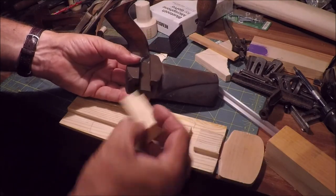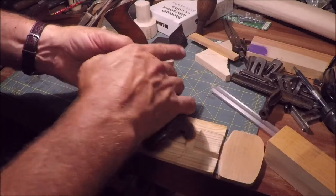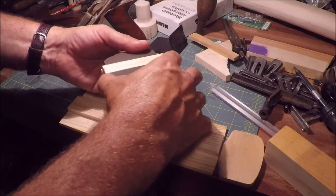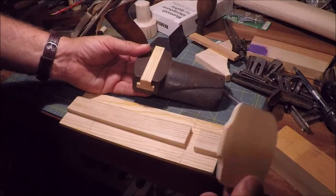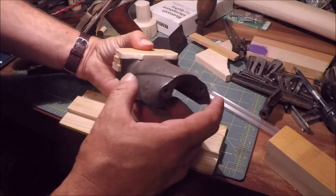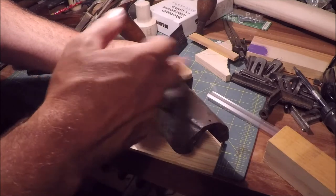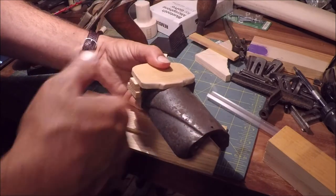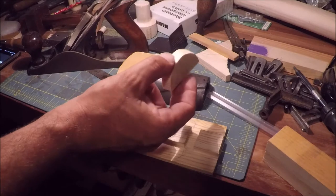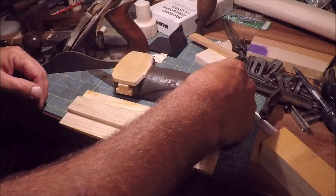I've made a lot of this stuff off-camera already. Here's the T-slot piece - these things always want to go in one way rather than the other. That fits in there, so we've got that pretty much filled up. Here's the plate piece to add machining allowance, and this will leave it higher so somebody can use an AXA style tool post, or it can get machined back to be just like the originals.